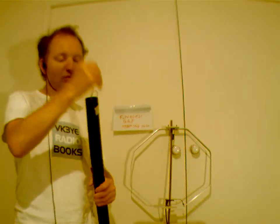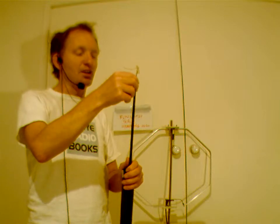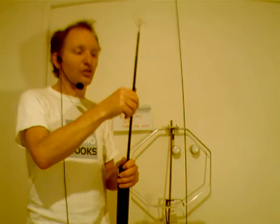Another thing I'd steer clear of, especially if you're using light portable poles like squid poles to support your antenna, or even wires and trees, is anything that's too heavy or complex. Always avoid complexity. Traps, loading coils, etc. are just the thing to get snagged in trees. The tops of squid poles are often fragile; you can see I've broken the thin top of mine. If you've got antennas with traps and loading coils, that adds weight and that causes the pole to droop and the wire will sag. So if you can, try and stick with simple wires.